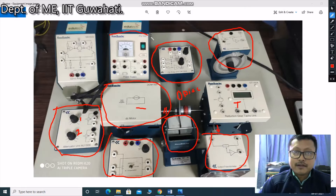This is the power amplifier. This is the power supply from where we are getting the required DC voltage — positive 15 or minus 15 — to our DC motor. This is the servo amplifier from where the motor is getting the power. From the power supply, power goes to this servo amplifier, and then the servo amplifier is internally connected to this DC motor via cable. These are the components.